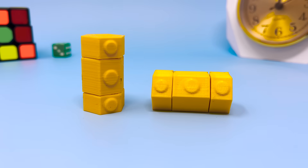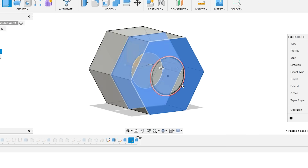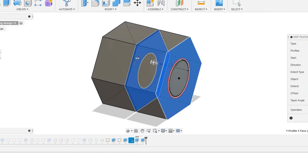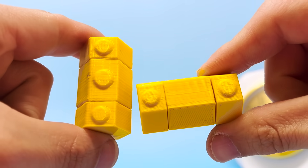But all of those are traditional living hinges, where the material itself flexes — and that's not a very good way of making a hinge. What if you could just do the hinge traditionally where it actually moves around an axle? Here 3D printing has a fantastic advantage because it's able to make parts inside of other parts without having to assemble anything. So you have hinges where a flexible point moves around a central axle that was all printed as a single piece — nothing was screwed together. This part was grown like this.